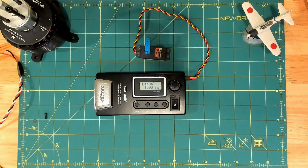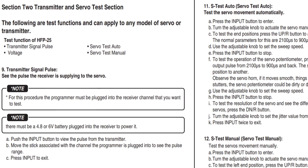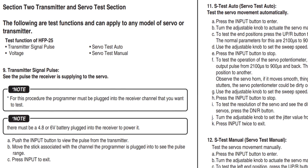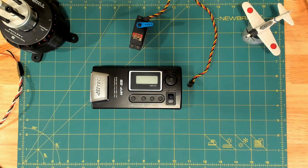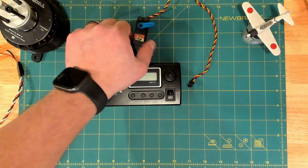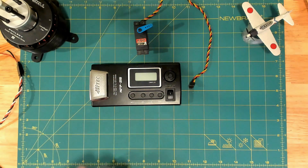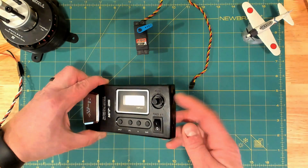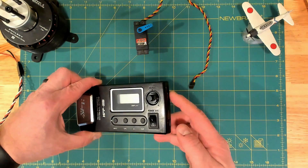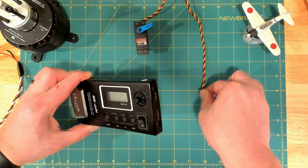The 30 is a little bit different. What's cool about the 25 is that there's a servo port underneath the main port on the right-hand side — you can plug that into your receiver and into a channel and measure the outgoing pulse width from your radio. I use a Jeti radio and can actually see that within the radio, but most radios you can't. So the 25 is a great tool to measure what exact pulse widths are coming out of your radio channels. Also, there's no way to view what was just programmed on the 25 — you have to reset and reprogram again.